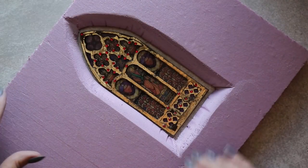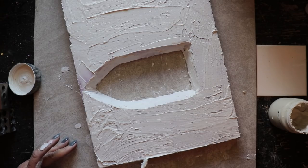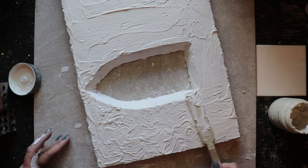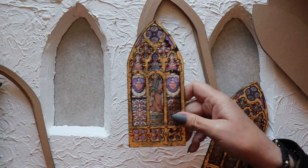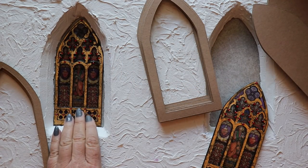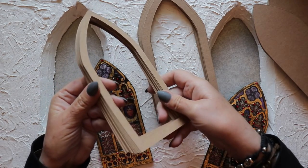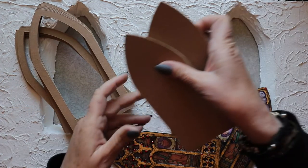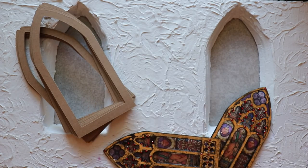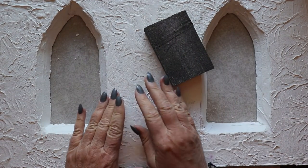I'm still relatively pleased with the fact that we're able to maintain sort of the same angle as we work our way around this aperture. It looks pretty rough which is why I'm going to be working it with a variety of metal files and then using sandpaper as well. This process does generate quite a bit of dust so I recommend that you grab and use a dust mask while you are filing and sanding. A quick dry fit just to make sure we're on track before coating the entire inner panel with joint compound. Once I've got the panel covered with the compound I add just a little bit of texture, which I'll be knocking back with a sanding process once it's dry.